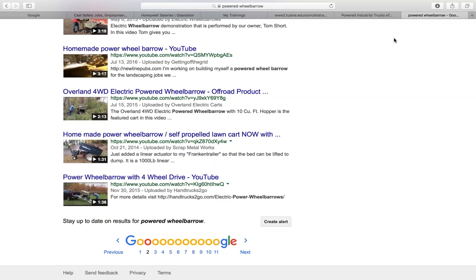I'm switching over to page 12 now. And remember this. If it's a motorized piece of equipment, a powered wheelbarrow, a mud mule, a concrete mule, a forklift, if it's powered, we've got to qualify our employees on how to use that piece of equipment, okay? I think that's where we miss the mark a lot of times. So just make sure that you have the employees adequately trained, hazard awareness trained. It's a powered industrial truck. Just keep that in mind.